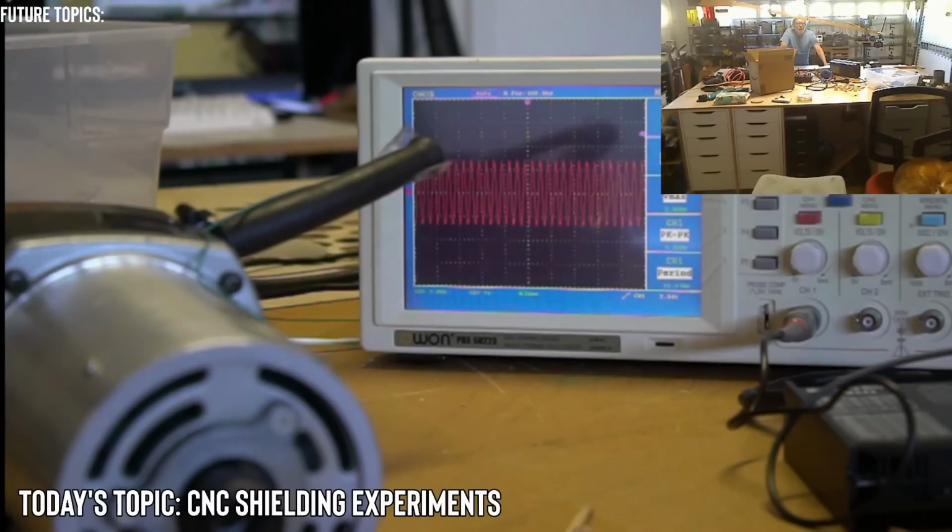By capacitive coupling, I just meant the noise that transfers from the one wire to the next through the shared capacitance between the wires. Yeah, we can test that. We only have a single wire right now, so the capacitance we're seeing is the dielectric between the conductor and the AC cable connected to the AC.